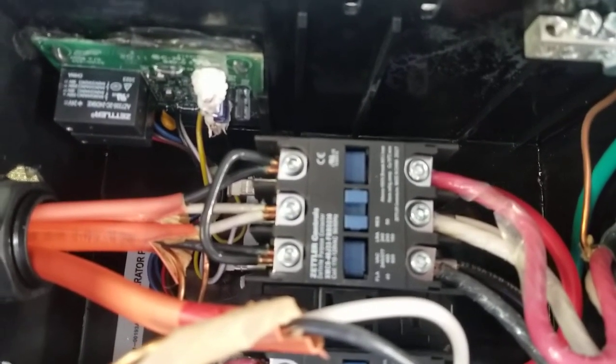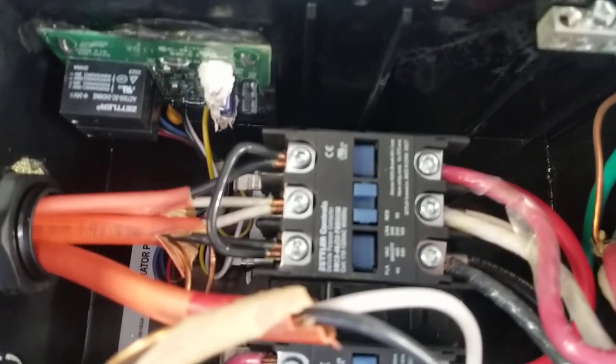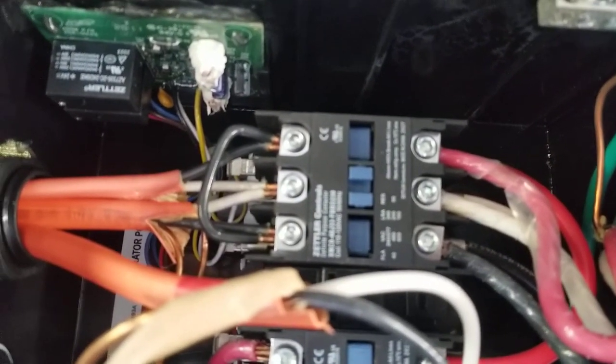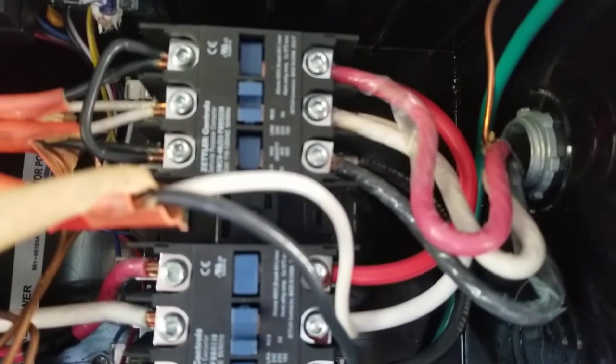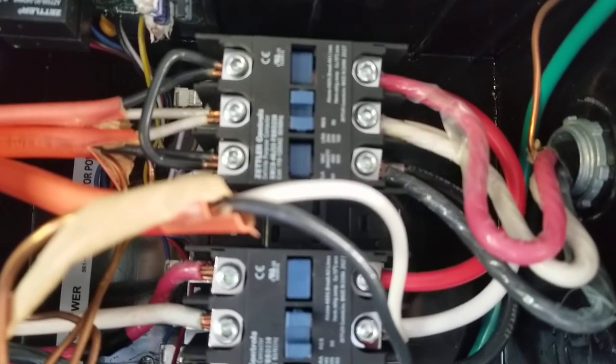So we have a 120 volt input, but we can still do the full 50 amps because we're teaming up those two 10 gauge wires simultaneously, and then they're feeding into the factory wires right there that go into the system control center with the 50 amp breakers again. Another set of 50 amp breakers.